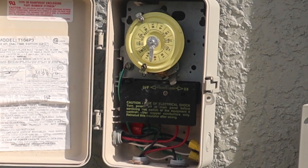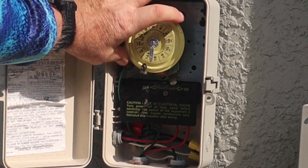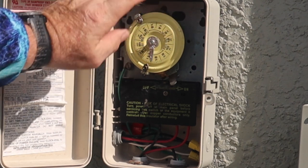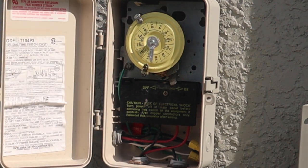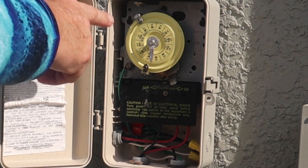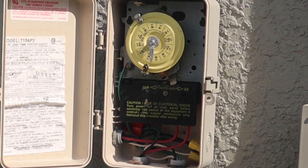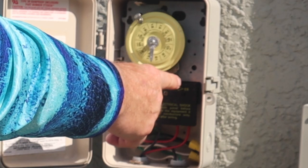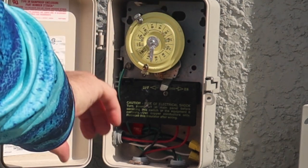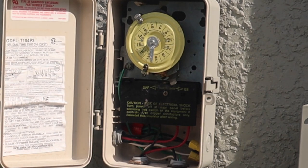I want to show you how the timer works. You set the clock time — it's 5:13 — and once you do that, unless the power goes off, you shouldn't move it again. These little tabs you slide around the wheel wherever you want them — one says ON, one says OFF. Wherever you set it to ON, it turns itself on. Just a little before 8 a.m. it turns itself on; it turns itself off about 4:45 p.m. When it comes around to OFF it flips the little lever and turns itself off; in the morning the ON tab catches the lever and pushes it on and the pump turns on.